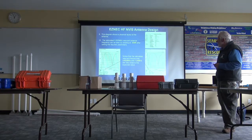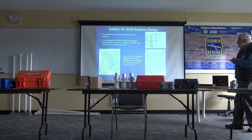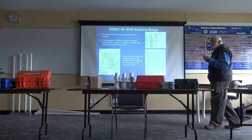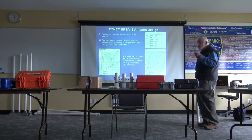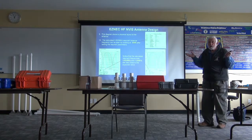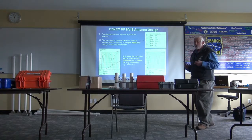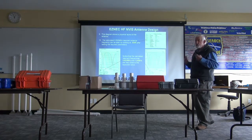Are these antennas more designated to one particular frequency, or is there a bandwidth range we can expect? Very good question — there's your bandwidth, from one side to the other at the 3 dB point. You do need a tuner with it if you're going to change frequency. If you wanted to operate right on that resonant frequency, you wouldn't need a tuner. But we know you're going to want to change frequency, so you do need a tuner.